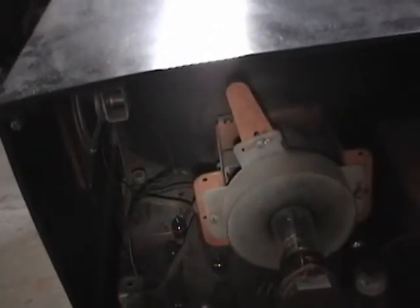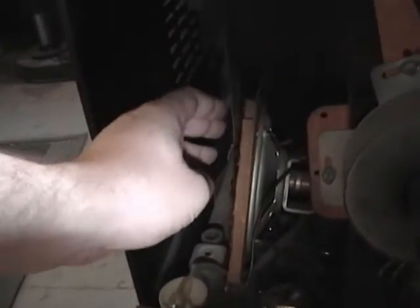I'm also curious about this picture tube - I can finally verify if it is a 16 or a 17 inch. There were no screws holding this chassis in place, which is pretty common. All I need to do is get this speaker out of the way because as I pull this back the picture tube is butting up against it. I think all I need to do is flip up this piece of spring steel. Flip that down and now I can pull it out. With the speaker out of the way, the chassis slid right out. Here's a look at the front and I still suspect this is not the original picture tube - I think the original would have fit tighter in these corners. Hard to say for sure.